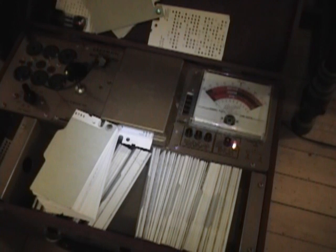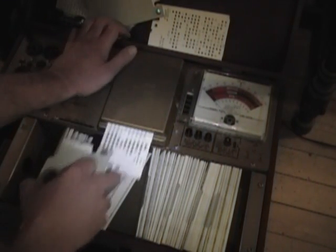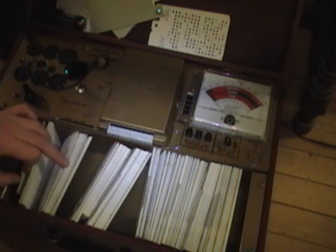Now let's go on to... Oh, let's check the 6V6. One of those 6SN7s is a horizontal oscillator, and we don't have any high voltage, so I thought maybe that tube might be bad, but nope. Where is the card for 6V6?